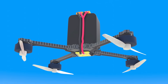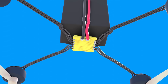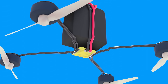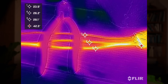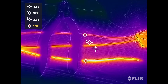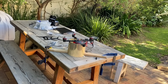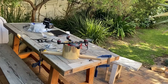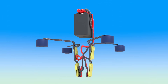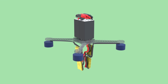With so much power, the bottleneck was the motor speed controller. Version 1 had a single controller to handle the power to all four motors and it was maxed out and overheating. These controllers are switches that adjust the speed of each motor thousands of times per second and manage huge amounts of current — make it very hot and they can be fragile and temperamental. We were going to need four controllers to handle the 9 kilowatts or 12 horsepower Luke had in mind. Full throttle lasts just 7 seconds and after that they are so hammered there is just enough to land. The positioning of these four controllers dictated the placement of everything else whilst maintaining the most compact design.